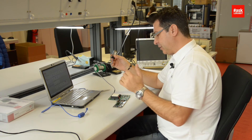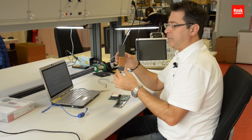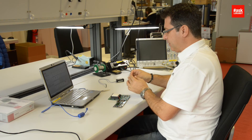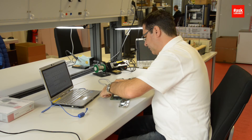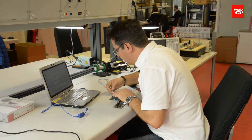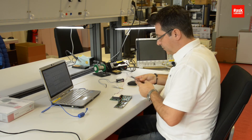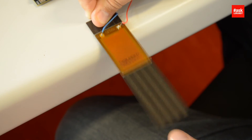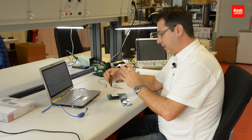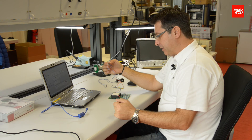Harvesting motion, harvesting temperature, harvesting solar. Of course you can also connect a PI ceramic piezo harvester instead of the inductive harvester. It doesn't need careful polarity because it makes AC current anyway. Now I'm connecting it to the terminal block — the piezo harvester — and moving the jumper back to the piezo. With just a simple movement of this piezo, it's enough energy collected to operate at 3.3 volts and almost 50 milliamps maximum current, which you can supply if you continuously shake or use this piezo harvesting.